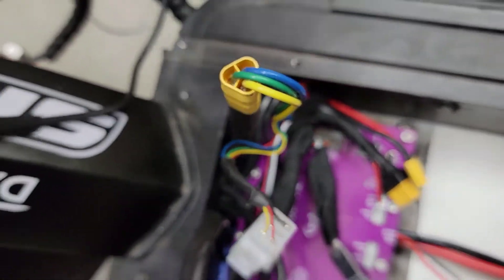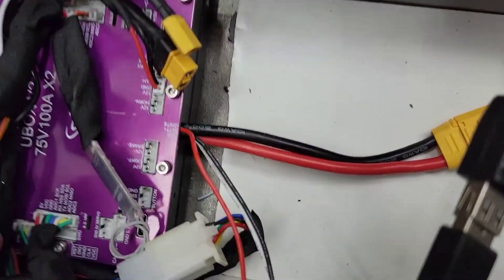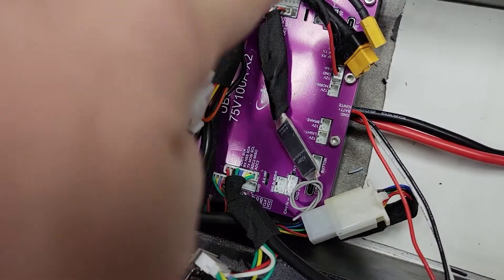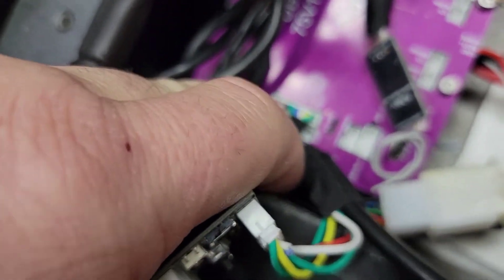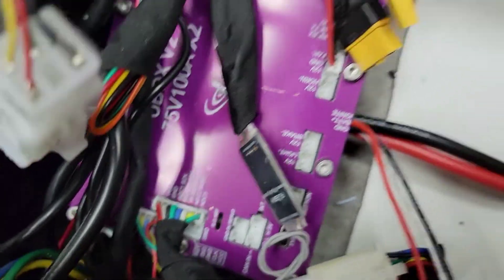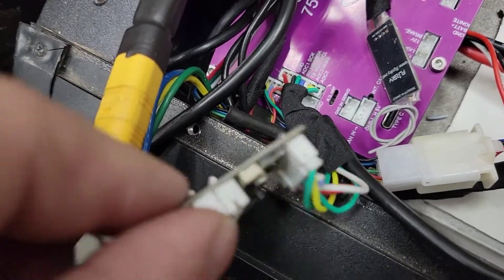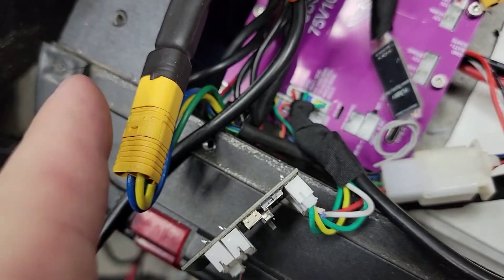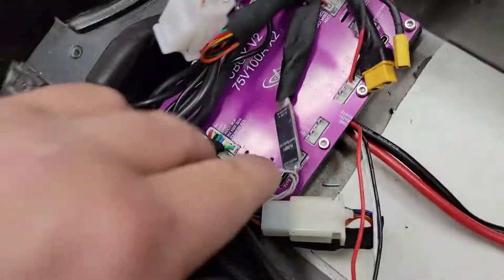Right now I have to route through the deck first. This board connects to either side of the U-Box — I chose the left side because it's just closer and easier. All it needs is 5 volts and ground. ADC1 is connected to the throttle, to green. And ADC2 is hooked up to the brakes. So ADC1 will see a variable voltage input, and ADC2 will be just shorted or not.